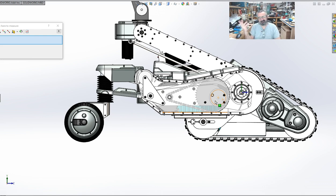But guess what? You need to do that with about 1,000 pounds of force, at a minimum. Well, there's your problem. You can get very powerful actuators, but the trade-off is that they're geared way down. They are slow.